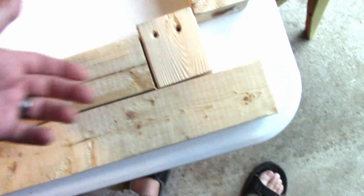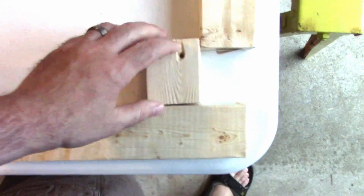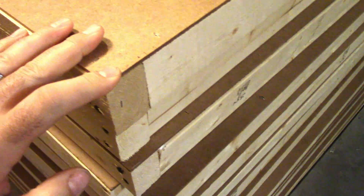You could take the whole frame, flip it over, do the next set, flip it this way, do the next set, flip it over again - and that way you had a perfectly square frame. At least that's what we thought, and it worked out pretty well for the most part. But we did find that once we started attaching the panels, they wouldn't line up correctly even though everything was square. My sister came up with a good technique: we'd staple the short 4-foot side first, then go to the other end without stapling anything else. If the frame wasn't matching up, you could tap and slide it to square it up, then staple it down for a nice, neat, uniform finish.